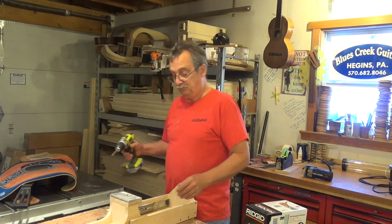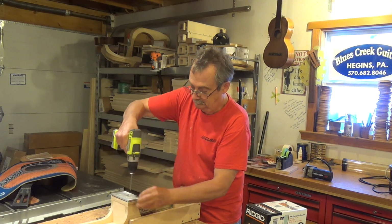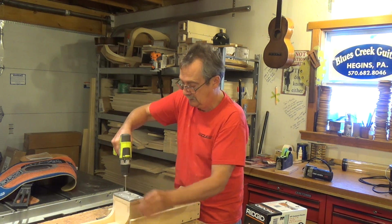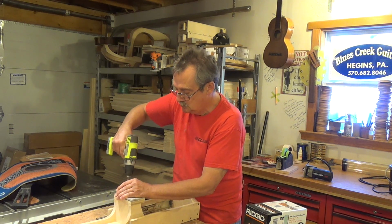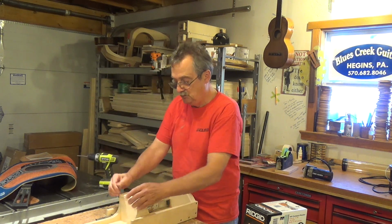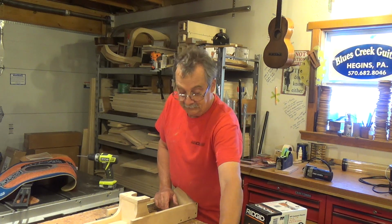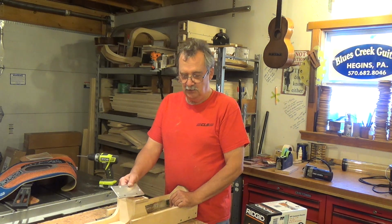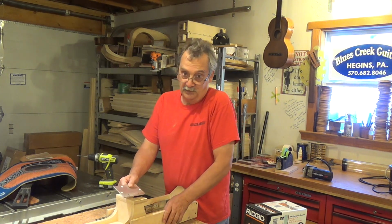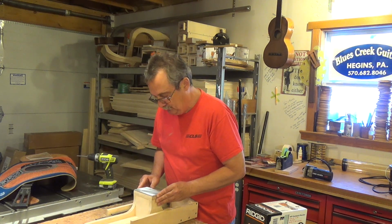So I'm going to take this mounting plate off. Now for those of you who like to make your own stuff, you're welcome to do that. And you can see how easy that was to take off. The spacing of the holes here is 2 inch 320 thousandths, roughly about 2 3/8. It's a metric number actually. So here's what we're going to do.